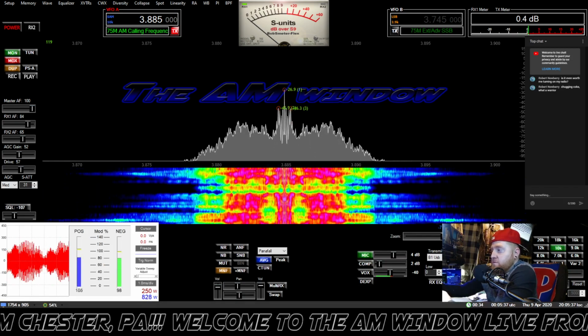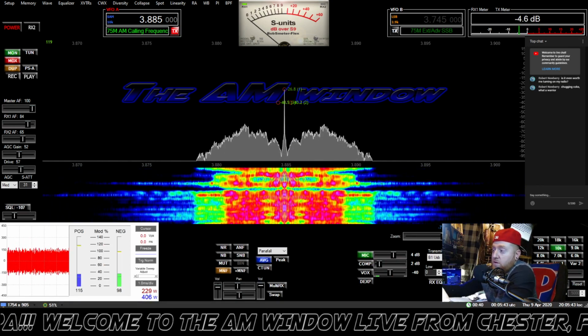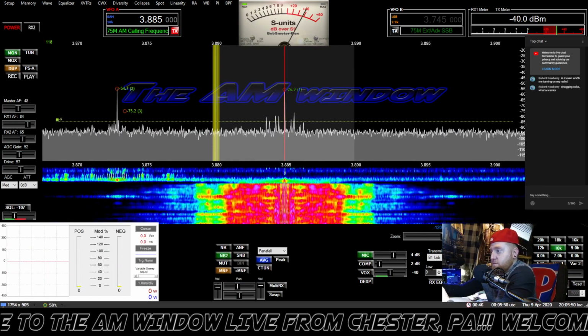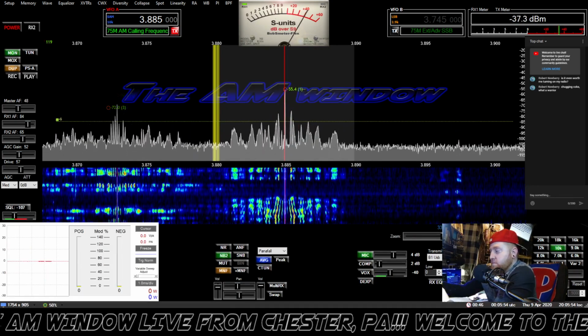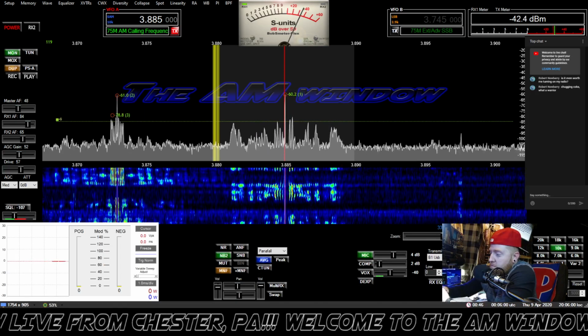But I usually try to do as much legwork as I can first and try to pinpoint it down to a pole or a residence or anything like that before I go ahead and get somebody out here. Perry, I went around with an AM radio. Just a standard old AM radio, unless you have something better. And I was able to find where the noise was coming from.